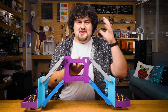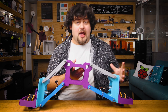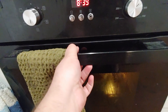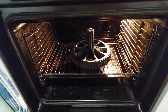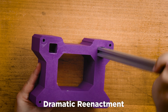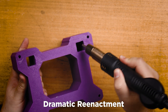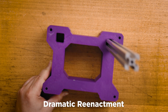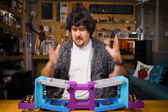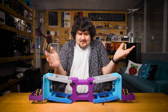That's also why I like working with 3D printed parts — once printed, they're super easy to work with. A lot of glues work with plastics, it's easy to sand down, and it's meltable. Some of the wheels on our Esky robot got a little bit warped, but with a little bit of heat we managed to soften and straighten them. When I printed purple pieces that connect to the 2020 extrusion with holes a bit too small, I just softened them with a heat gun and rammed the extrusion through. So when deciding on a material, think: will it be strong enough, does weight matter, and how easy is it to work with?